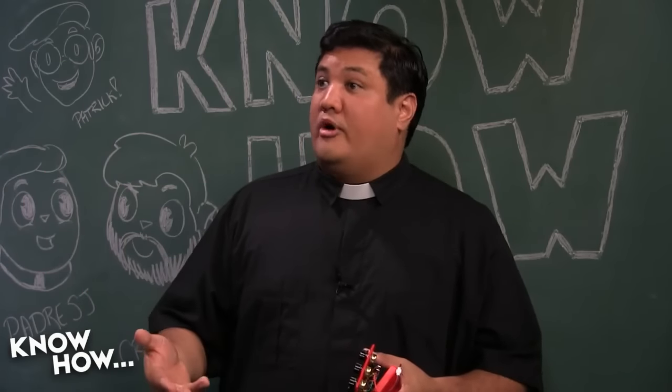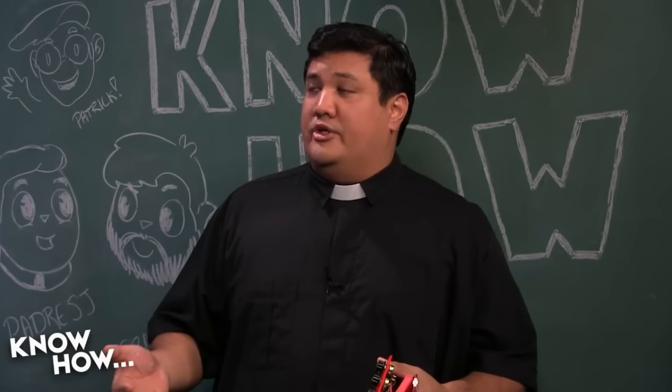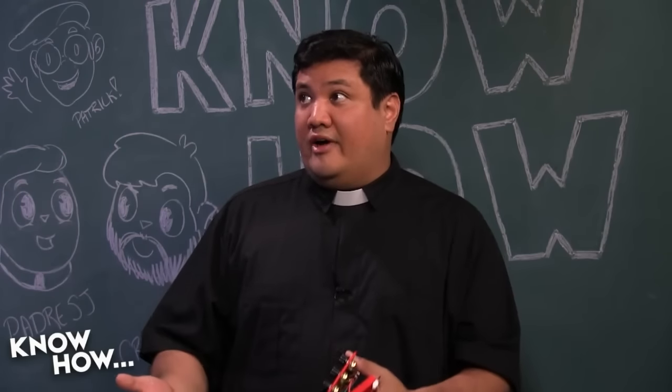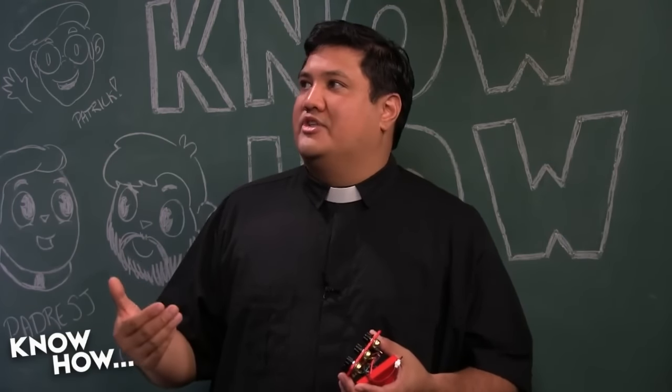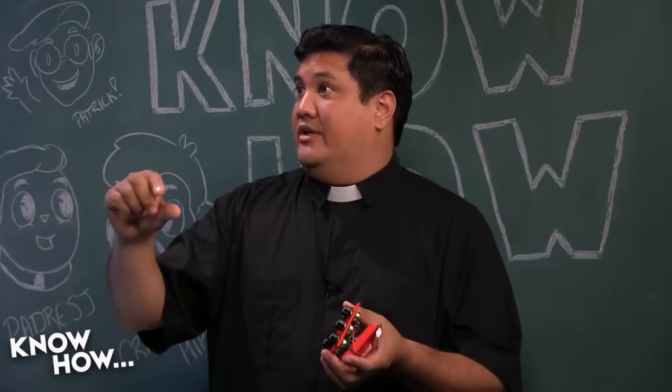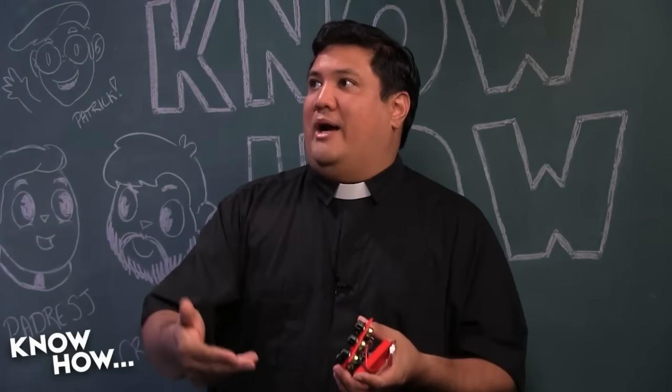But does it have any application to use power off of USB? Is there a reason they have that in there? Yes, absolutely. A lot of our projects do run straight off of USB. You can get 5 watts, so as long as it's below 5 watts, you're fine. The problem is when you start hooking up things like power adapters, UBECs, it tries to power the UBEC from the wrong side, and then you end up drawing more current than the Arduino can handle.